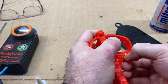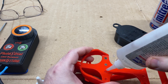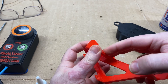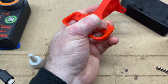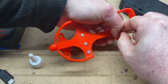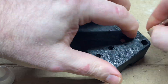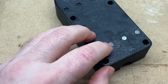Hey, future me here — just wanted to mention that after I got this put together and used it some, I found that where the magnetic grip was stronger than the super glue, you could actually have the magnet from one side pull the magnet out of the socket on the other side. The way that I've fixed that is by editing the design to put the magnets in from the underside of the cradle and from the inside of the bottom of the case, so that the magnets attracting to each other will always have one thin layer of printed plastic between them. Their attraction then pulls them into their respective sockets rather than tempting one magnet to be pulled out. Hopefully by the time this video gets published I'll already have that new version of the printable file uploaded and ready.